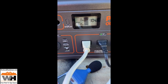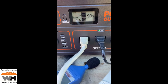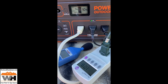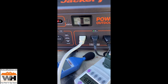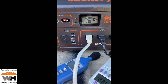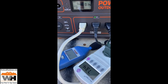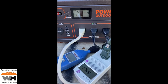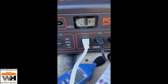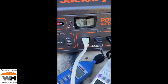At the half-hour mark, we're down ten percent. We're bouncing somewhere between 120 watts of draw and can peak up to 250 watts during this full test of all six speakers at the same time. Now at one hour in, we've used about 19% of the battery to get to this point. We've kept the volume and draw at the same level pretty much throughout so people can see what it can do.